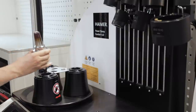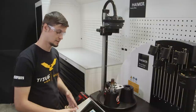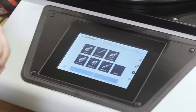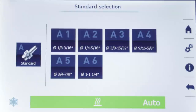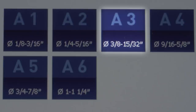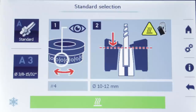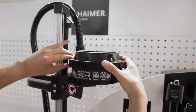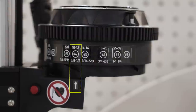Once it's all nice and clean, I'm ready to configure my settings — this is an important part of the process. This particular tool holder, from my prior research, I know is going to be a standard class and its size is going to be in between 3/8ths and 15/32nds — that is called A3. Once I have that, it gives me the instructions on what number to set my coil, which will open and close the eye for the right diameter of this holder.